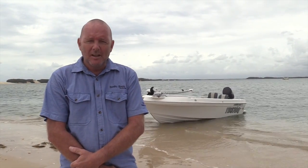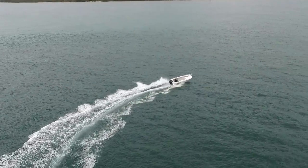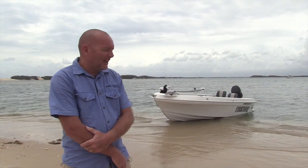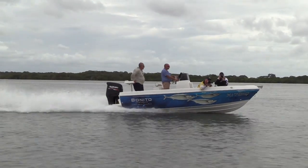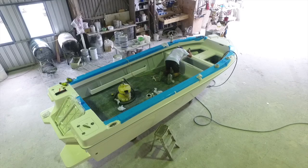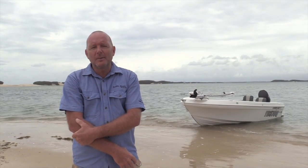Adam had the boat about a year and a half ago. He fishes a lot, inshore and offshore. The boat's a 5-metre sports tiller steer from Benito, fully moulded, all fibreglass, quality build. We don't use any structural timber in our mouldings. We can get the 5-metre in the tiller version as you see here, or the centre console, and we also do a side console. Our next model up is a 5.6-metre, available as a tiller steer, side console, or centre console. We believe timber doesn't belong in boats nowadays. We're using a thermolite composite panel instead of timber in the floors, bulkheads, and transoms. It's impervious to water — it'll basically last forever — and all Benito's are made as standard with that material.